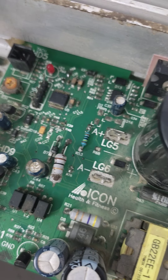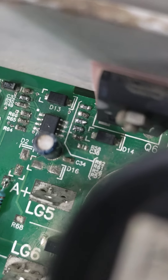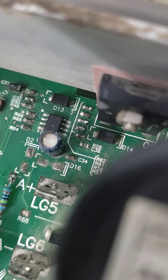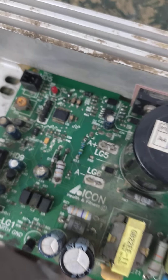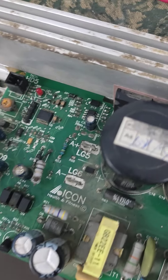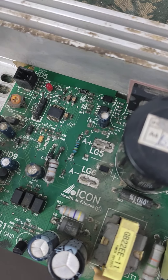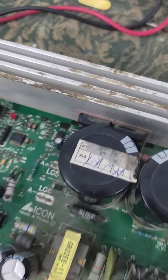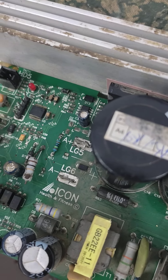Specifically, in front of D13, there are two resistances that were 200 ohms each, placed in parallel making 100 ohms. One of those resistances was open. When repairing a card, the very difficult thing is identifying a resistance that is short or giving a wrong value.